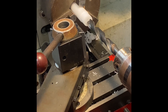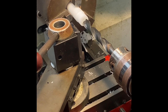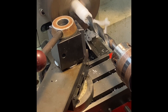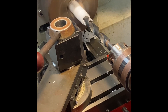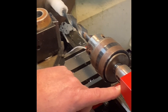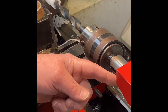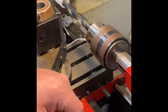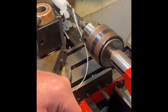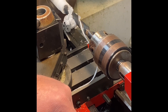I've changed to a 21/32nd drill and slowed my RPM down to 600. We'll go ahead and drill this out again — I'm only going through about an inch. As I go in, I can read the measurement of how deep I need to go off of my scale right here on my tailstock. I'm seeing one inch and can go to about two on my tailstock. I'm an inch deep, so I'll bring the drill bit back out of the hole.